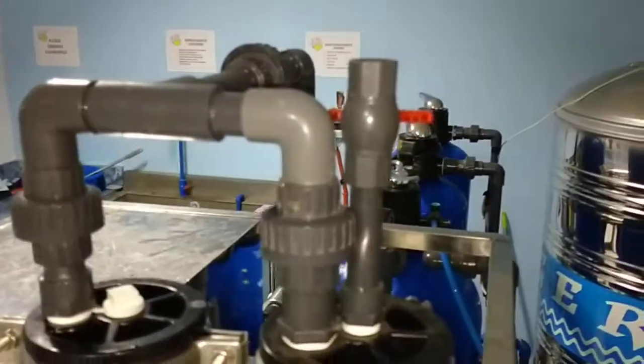So the raw water that we process in this refilling station is 1,200 parts per million TDS. So we cannot use any ordinary membrane, only this BW30. Okay. So we are now currently curing the solvent. So that's it right here on Water Process and Engineering Services.